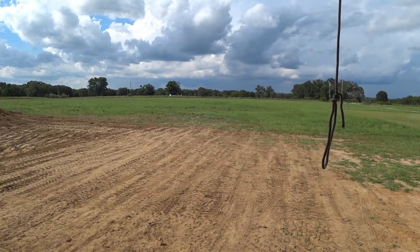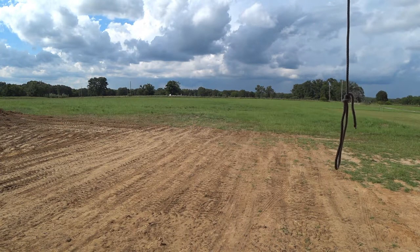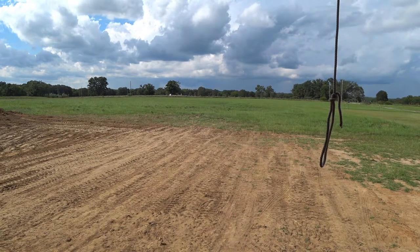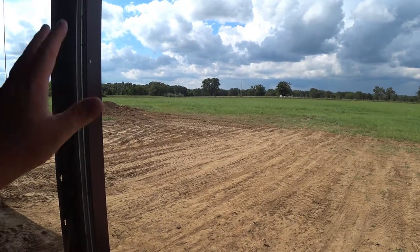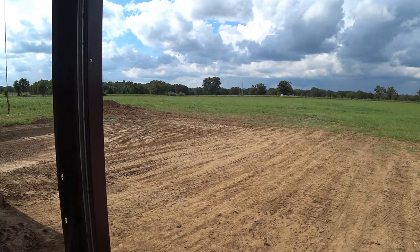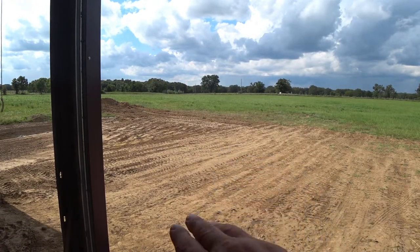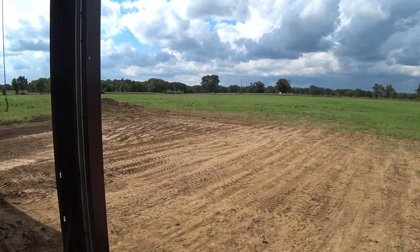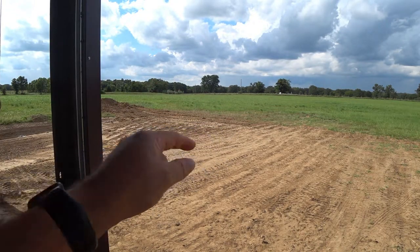one of the previous videos was me cleaning up out here in front of the doors, and it was because the grade was sloping back toward the building over here on that west side, and now I think I've pushed it back to where it's sloping that way. The funny thing is, the way your eyes trick you in relation to the rest of the land, that part over there on the west side to me looked like it was still sloping a little bit toward the barn, when in fact it's actually running about an inch or two downhill from the barn towards the north.